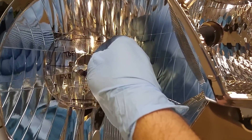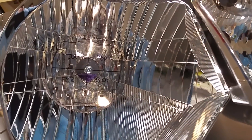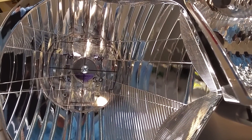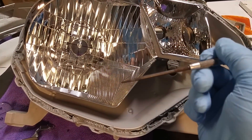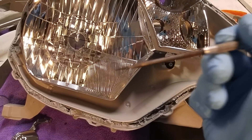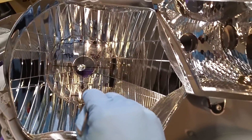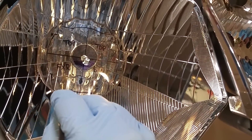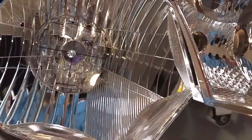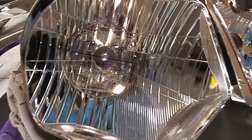Somewhere about like that. And then you can see if the screw is kind of going centered right down the middle there. And then I can use either a Sharpie or some kind of a little scratching tool like this one that I have here — just essentially a sharp pointed object. And I can go inside these holes, kind of scratch out where I need to drill my holes for the nut and bolt method. Or if it's close enough, you can just use a Sharpie and mark some holes in there.